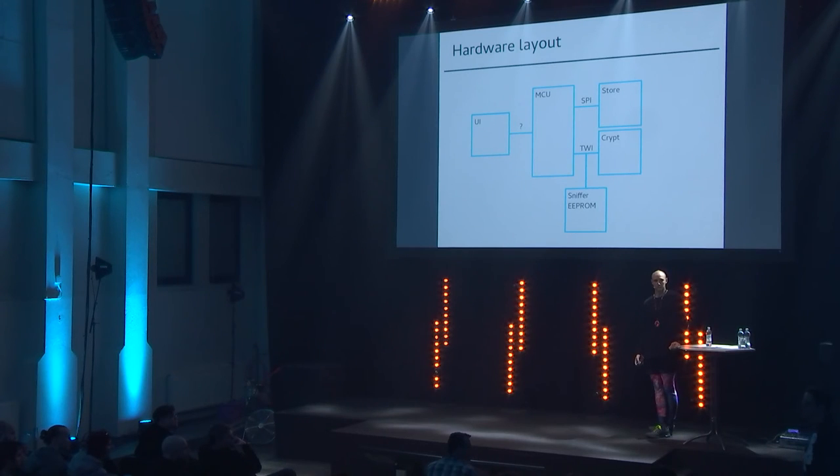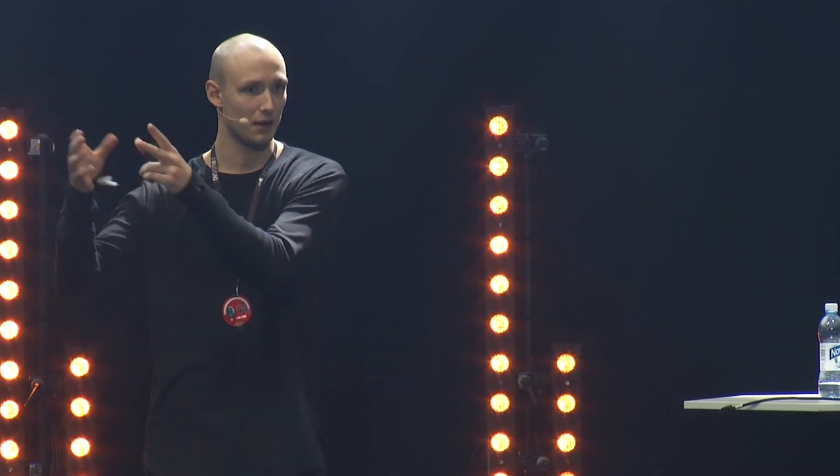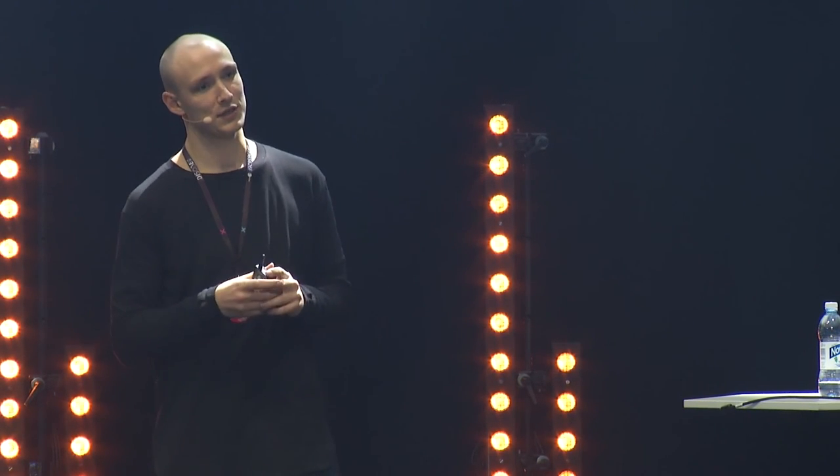Question: what hashing algorithm is used for the 3-byte digest? I have no idea. When you enter the password, you pick from a fixed set of words by first picking the first letter, then suggested second letters until you find the word, then another word the same way, and it magically turns that into three bytes. I'd probably have to dump the firmware to know. And dumping the firmware might reveal other things — like maybe a USB exploit where you send bad data, it crashes, and you build a ROP chain. Cool stuff I don't know how to do yet.